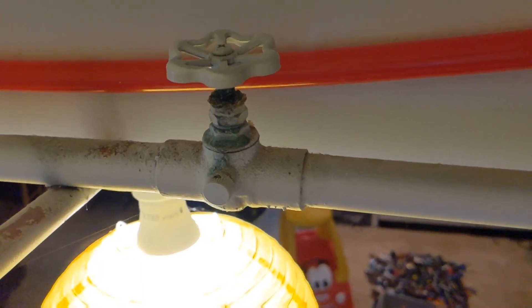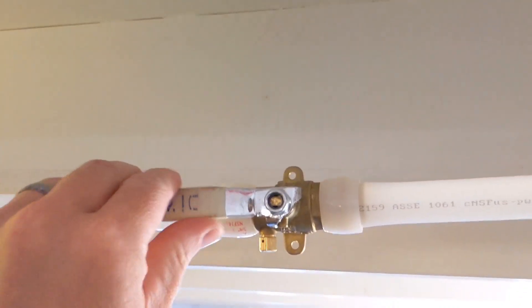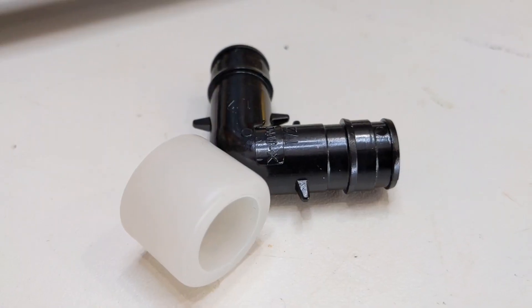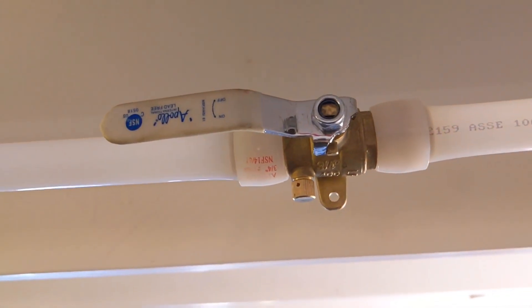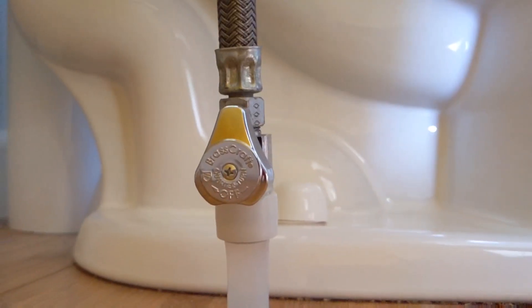In this video I'm going to show you how I replaced two broken gate valves in copper pipe to quarter turn ball valves in PEX-A pipe. I used a PEX-A expansion tool with the matching fittings. The whole setup was surprisingly cheap, and even easier was using it, and I've never used it before. Let's get into it.